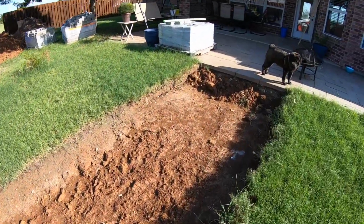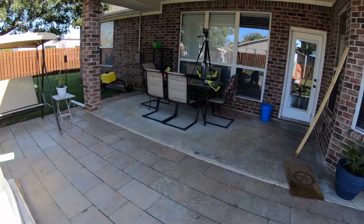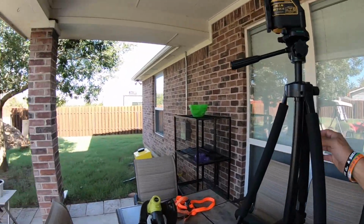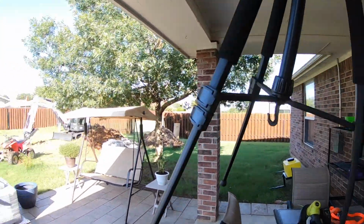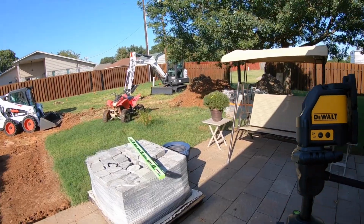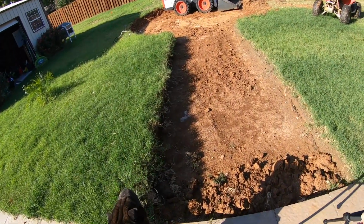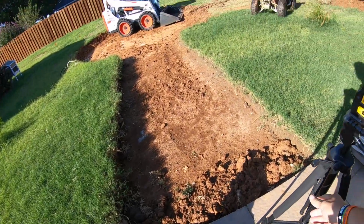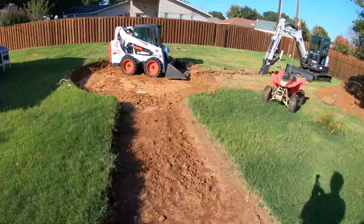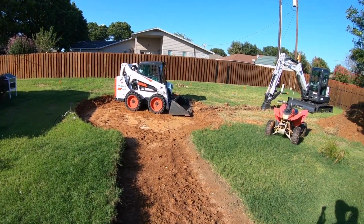So essentially we're gonna set this leveler that we have over here. About this DeWalt leveler, just set this on this main level here, and then actually we can do it anywhere because it self-levels. So just shine and put a board out there, make sure all the levels of that circle are the same height from here.